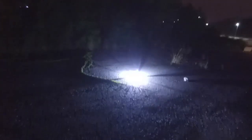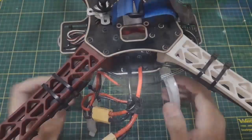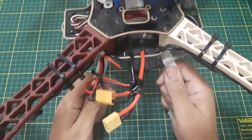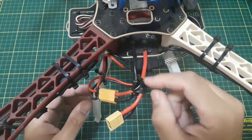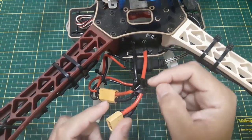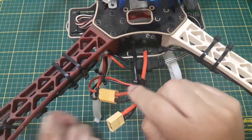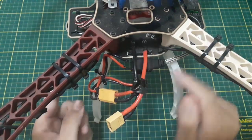I forgot to talk about this modification. It was very simple — I took everything that was here. The images you saw were made this way: I simply took these two cables here, which are the power supply of the drone going to the battery. I opened a piece of the wire here and made a connection — I just took two wires coming out here to power the lights, the LEDs.